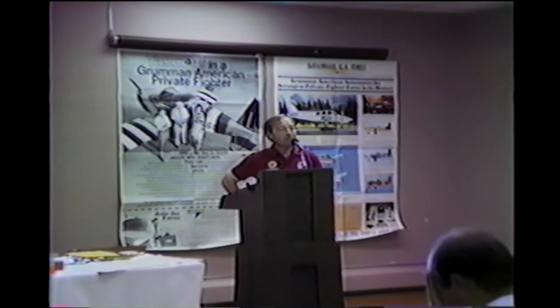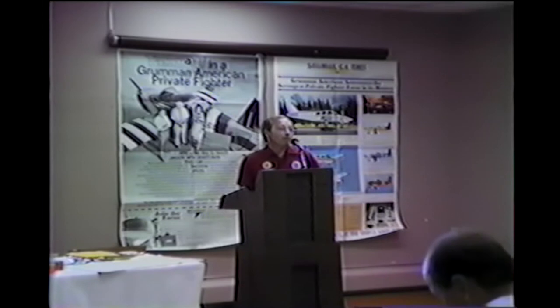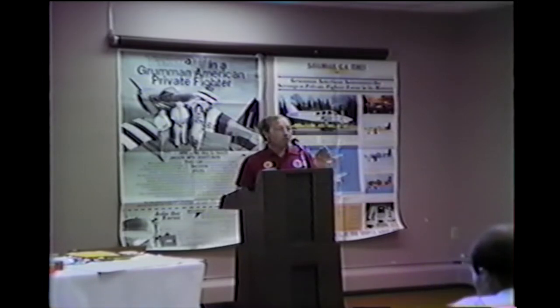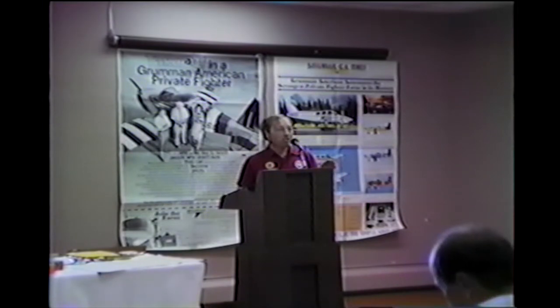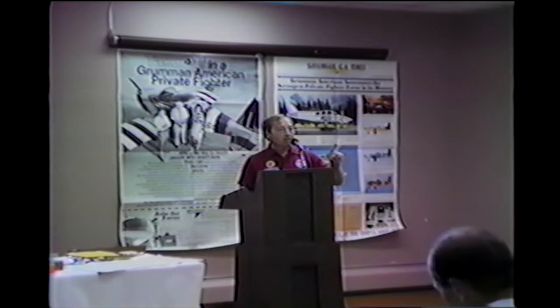Dave, why don't you come up here and take some of these questions, give me a little break on some things. What's that sealant number again? The second one I mentioned is PR-1435. PRC is the manufacturer of it. That's for the access panels, and that's your secondary sealant inside.